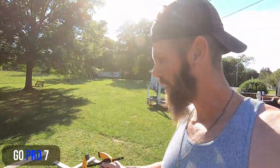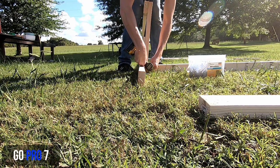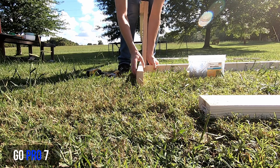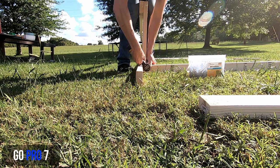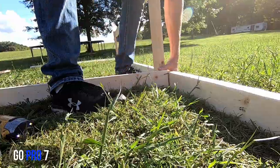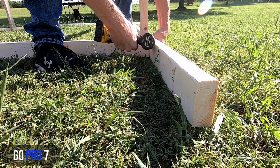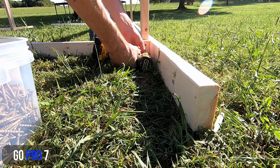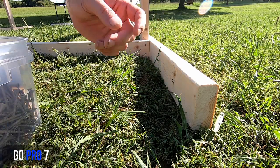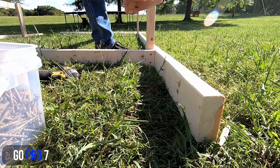This can get a little tricky by yourself, so get yourself a clamp — and at this point it's pretty much just connecting the dots. Always get stuff pre-started, get it where you want it, one screw at a time on each side. What you'll do later is come back and run more screws over here and tighten them up some more.